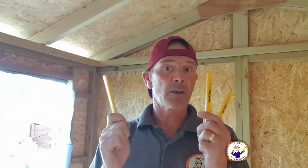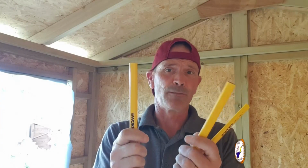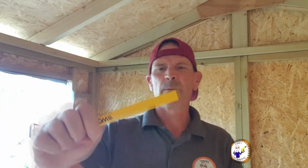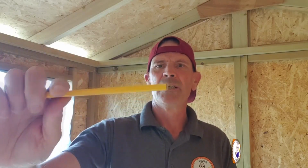And what I'm going to use for that is a pencil. I'm going to put 3 carpenter's pencils on the floor, because they are about 7.5 mil thick. They're about 15 mil wide, but I'm going to use them flat on the floor. I'm going to rest my first piece of cladding on that. Then I'm just going to staple it in place with brad nails. I will be putting screws in later. Let's get the first one done and then see how it goes.